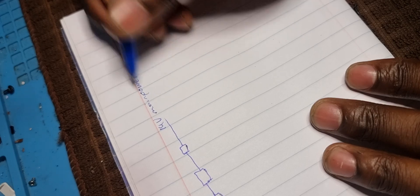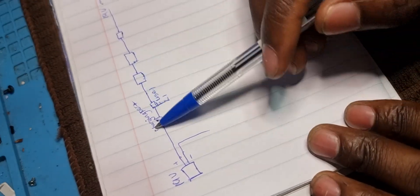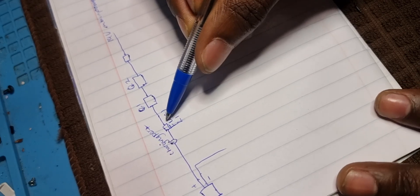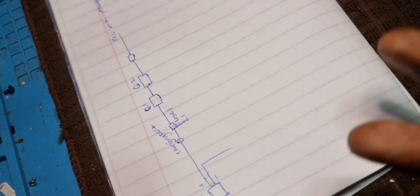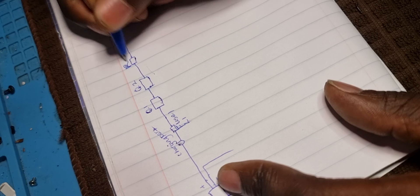Out of the resistor it goes into the rest of the laptop as your 19 volts main power rail. On a schematic diagram, MOSFETs are labeled as Q and inductors are labeled as L. The inductor helps smooth the voltage when you're plugging a charger and shaking it - that 19, 0, 19, 0 as you're connecting gets smoothed out. Then you've got your current sense resistor.